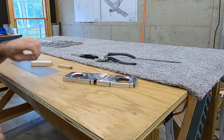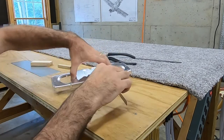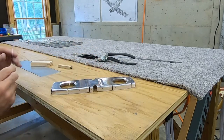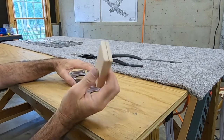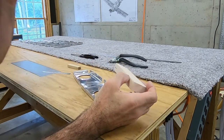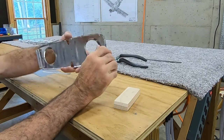The other thing I need to do — and they don't tell me to do this at the step I'm on in the plans — is when you look in section five about fluting, they tell you to also adjust the flanges to be 90 degrees with the web. Taking a straight edge, I can see this is not 90 degrees. There are a couple of ways to bend that: I can use the hand seamer, which I've done in the past, or some blocks of wood with slots cut in them, which I've made a couple of. The hand seamer is too big to get in some of these spots, and frankly I find the block of wood is actually a little gentler — the metal hand seamer left some marks on the vertical stabilizer ribs.